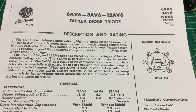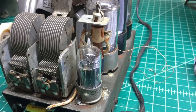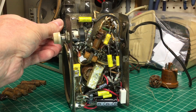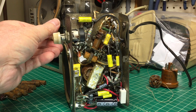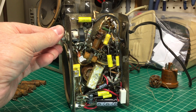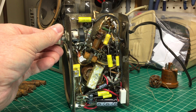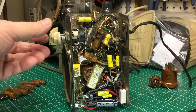I also ordered a 12AV6 tube — it's the replacement that came out in 1948 for the 12AT6. When it gets here I'm going to plug it in, give it a test drive, and double-check all the voltages. I'm going to spend a little bit of time on some of the rust on the chassis itself, and then we'll prep that cabinet down the road. Thanks for watching this little restoration series on this Arvin 402A from 1940, and thanks again to all my new subscribers.